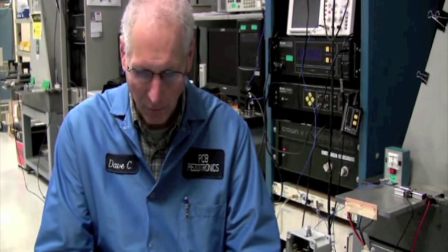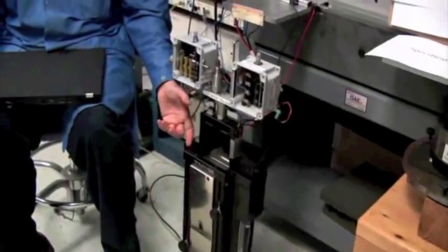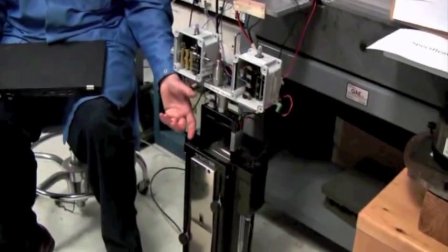Today we're going to compare the performance of three different types of vibration switches to sensing pure fan unbalance on large cooling tower fans. We will do this using a long stroke shaker to simulate fan movement at low frequencies and large displacements. This is the long stroke shaker. It has the capacity to go about 6 or a little more than 6 inches.